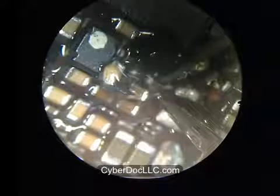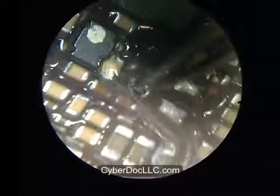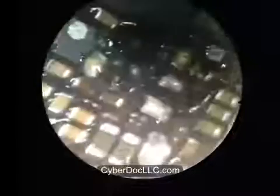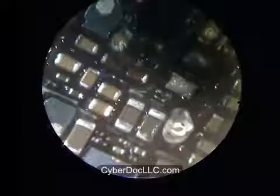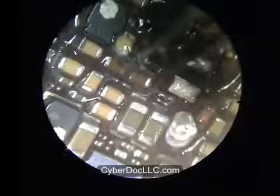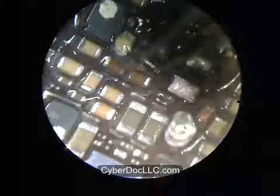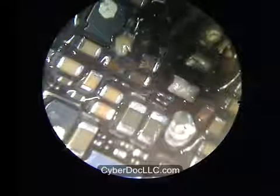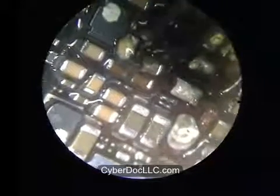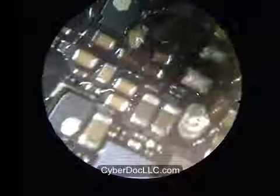Basically what I'm trying to say is this IC chip is directional. You cannot install one way over the other. It has a proper direction where it's pointing, and to help you orientate yourself, there are lines on the chip that act like an arrow. You want to match the lines to the right direction. It wouldn't work the other way around. The coil, however, is bidirectional. You can install it in whichever direction as long as it fits on the board, but not the IC.